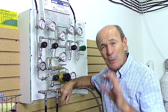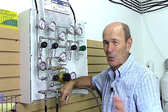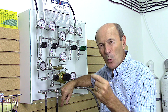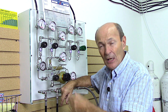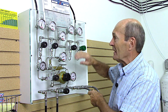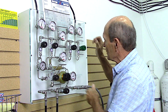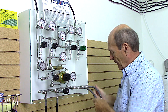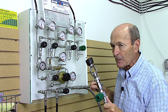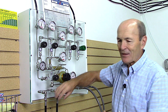We actually make nitrox here - you can't go to a drugstore and buy it. You go to a dive store, which depending on its size and sophistication will have different ways of making enriched air. We'll do a future video on how we make nitrox because it's pretty neat. The nitrox line comes down just like the others - all the air knobs are closed, we use the nitrox knob only, and we fill using a whip with a green knob on it. We only fill one nitrox tank at a time so it doesn't get mixed up with regular air.